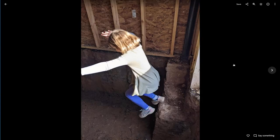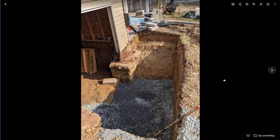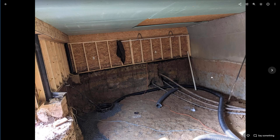It's big enough that my daughter wanted to jump down and have some fun. Now we're probably close to nine feet down, but after the gravel, the foam, and the concrete, we're back up to eight feet. Here you can see the French drain coming out and where we've kind of roughed in for putting in the staircase. More French drain action. Here we're starting to lay out all of the gravel and putting the crock for the sump pump in its final location.